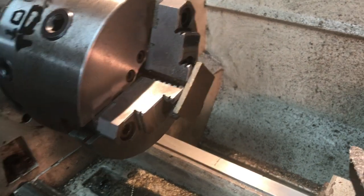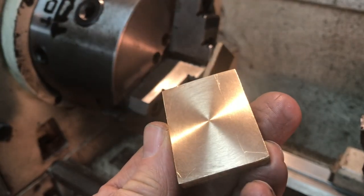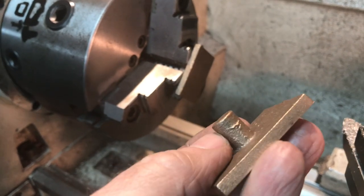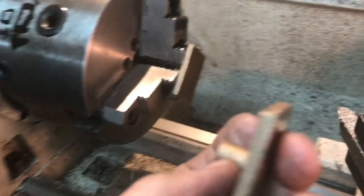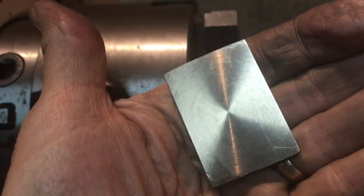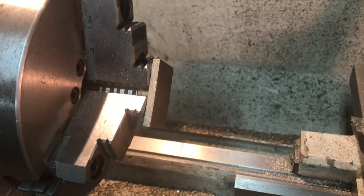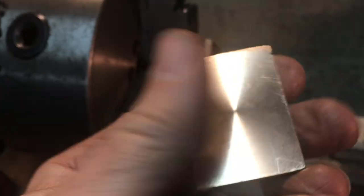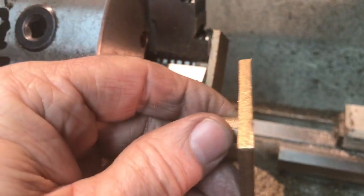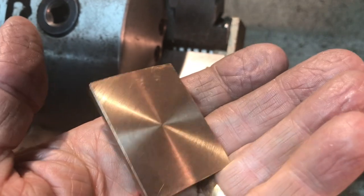Most of the work on the steam chest covers is going to be done on the milling machine — milling the edges to size and then drilling the holes. But I thought I'd go ahead and try the method they recommend in the book, because these little blanks I bought have these beautiful little cast-in studs that you can use in your three or four jaw chuck. I just finished machining this one. I used a regular high-speed steel sharp cutter. I only took off about 20 thousandths just to clean it up, but having this perfectly flat surface will make it a lot easier when I get it into the mill to mill the edges and hold it down.